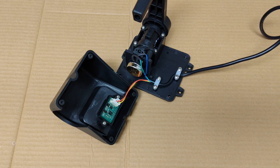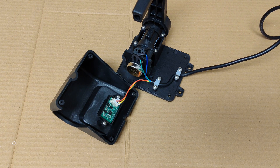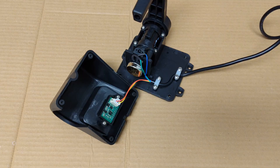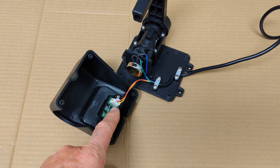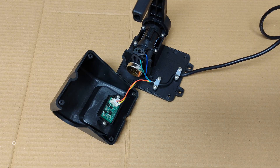This is the internal view of the lever controller. You have a potentiometer — reading the data off it, it's a 10K, which is the typical size used in PWMs. The blue and white wire go to the first two tabs on the pot, and the red, black, and yellow go to the display meter. At the center detent the display reads zero or off, and when you go forward or reverse you get a percentage of power on the display. That display also acts as the forward and reverse switch, which you'd typically see as a separate switch on other PWMs.